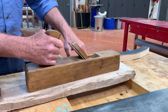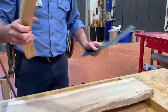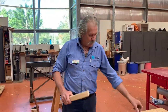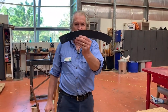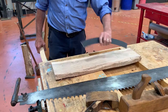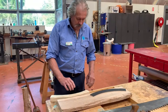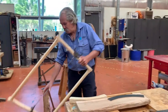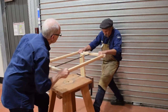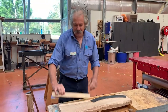This blank is now suitable for the next stage, which is making a felly. The fellies are the curved parts that go together to make up the circle of the rim. They're usually made to a template, and I can fit two fellies in this one blank. The next stage is to cut these into a curve — the tool used was called a felly saw or a frame saw. It's a two-person operation but it can cut a curve, and this is one we've just cut as an experiment.